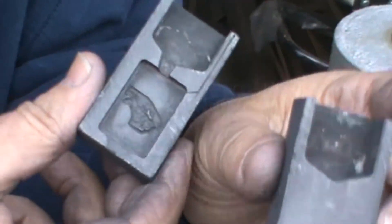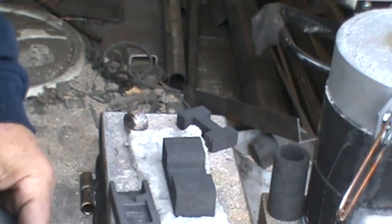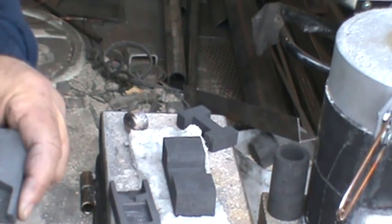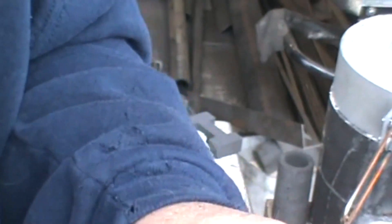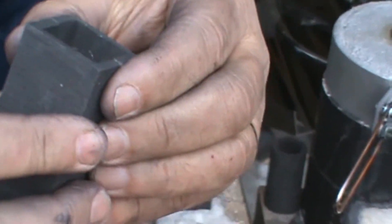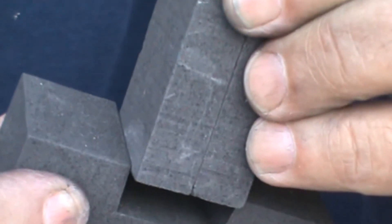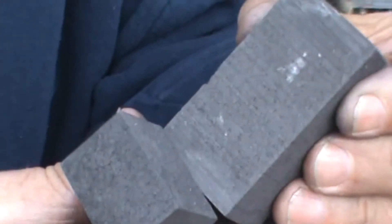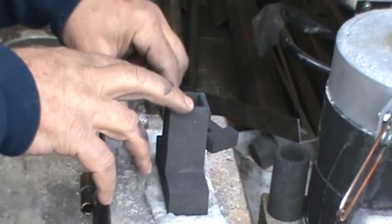So I've got the two halves here — the ingot and the back. I've got a little borax in here; borax works like glue in a mold. Just put the two pieces together, and then the base clamp — there's just a groove, the tapers not quite as wide as the two molds have, so it holds them together. No force at all — you just set it in there and put silver in.